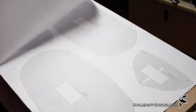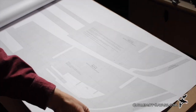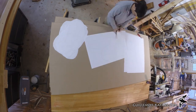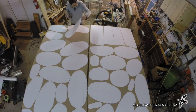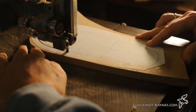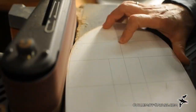I print my plans out full size on paper. Each form is drawn by itself with space around it. My expectation is that people will take these paper plans, cut out the form patterns and glue them to a piece of MDF, plywood, or whatever material they have that's suitable for making temporary forms. This can then be cut with a jigsaw or bandsaw and trued up with a stationary sander.